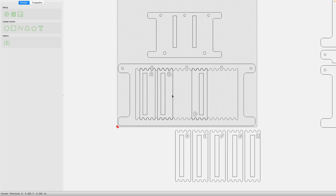You can use both sides of the jig if you need to do double-sided dados. And the great thing about this type of jig is that if you make a mistake down the road, or want to recreate a project years from now, you can always slip these inserts back in and get the exact same spacing you had previously.